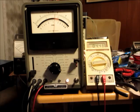VOMs I wouldn't use, and lower-end VTVMs I wouldn't check with the lowest scale. Be very aware of what your VTVM or analog meter puts out in the ohms range, because you might blow a filament or another device. The same thing applies to certain solid-state devices and even very small light bulbs. A lot of antique radio collectors and antique test equipment collectors might not think about this when testing those tubes. Best to just use a modern digital voltmeter — that should be no problem, as I've seen here — both were well within specs and would never harm the filament.